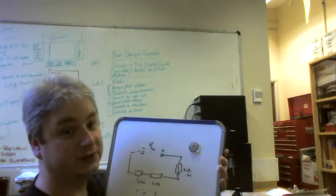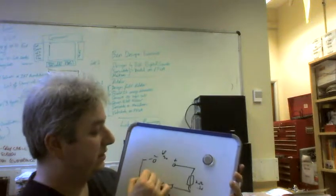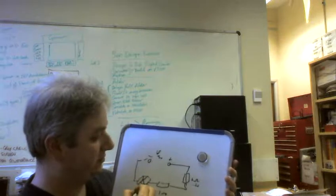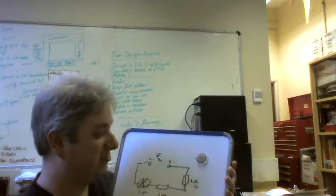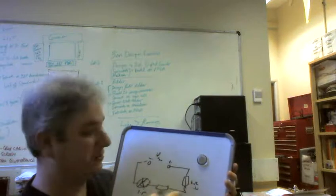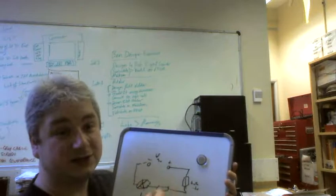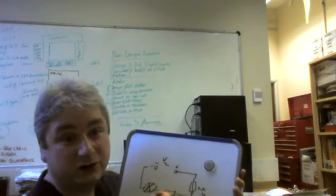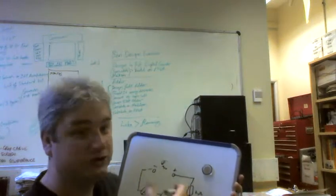For example, if this was a lamp that needed 1.5 volts to light, and it has an internal resistance of 1 ohm — by adding in the shunt, you no longer have 1.5 volts across here; you've got 1 volt. It's not going to light up, so your circuit isn't going to work properly. If your circuit doesn't work properly, it won't draw the correct current, and the current you measure is going to be wrong. You're going to get a huge error by introducing that meter when measuring circuits with very low resistances.